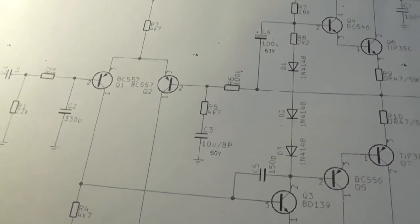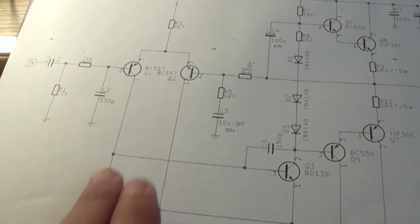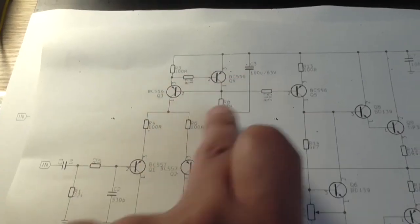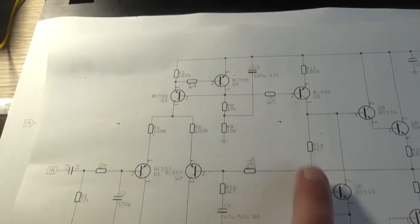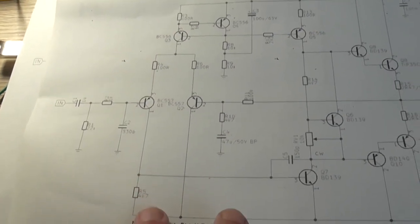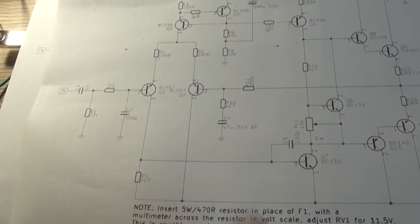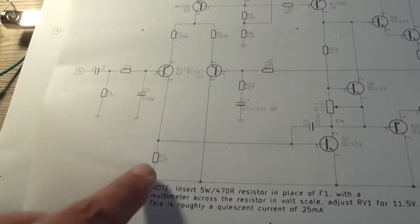I don't think it will. And failing that, I'll move over to this section here on the input stage. Now, if you remember, this is the old schematic. Here we've got a current source for the input stage and the output stage here. Now, I haven't changed anything down here. I can add a current mirror as described in the last video. But mainly DC offset of an amplifier is controlled by this first input transistor.